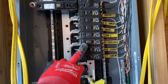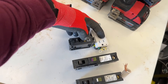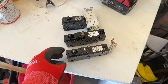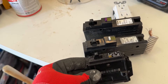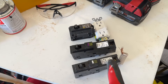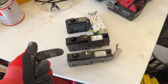I'm here in Nevada, so this is what they require — I would still check with your local codes. This is just a safer way to do it. It is essentially like a breaker or an interrupter before the actual breaker. All of these are dedicated outlet circuits and have GFCIs as the very first plug. These will be going to dedicated outlets such as my fridge, or going to the lights. What threw me off when I first started getting these is that I thought they were way too big — I must have gotten the wrong ones. You can see that they have a raised area right here; that is the same profile, so it does fit in the panel. It exposes itself the same way, but this allows us to have an interrupter before the breaker.